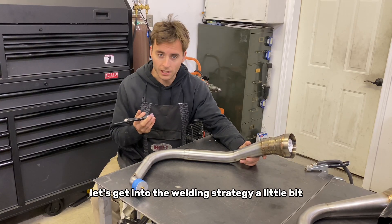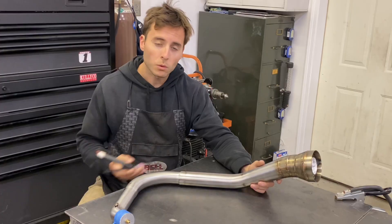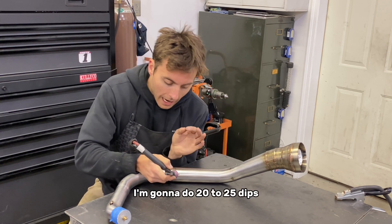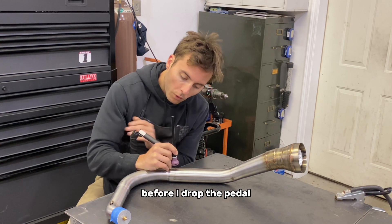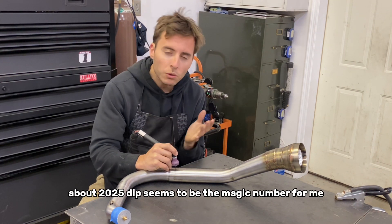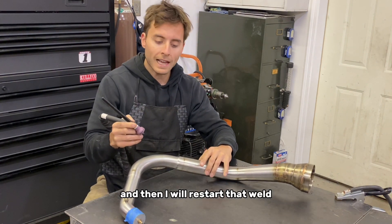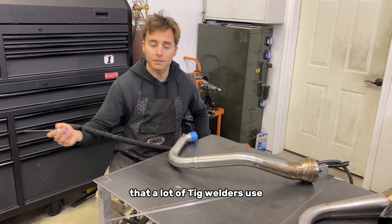Let's get into the welding strategy. Every welder is going to have a little different advice, but I've been doing this long enough where I've got a flow. When I'm welding my exhaust tubing, I try to do about 20 to 25 dips per start and stop. So when I go to light that electrode, I'm going to do 20 to 25 dips with my filler rod on this seam before I drop the pedal and stop that weld and let that post flow shield it out. About 20 to 25 dips seems to be the magic number for me. Then I'll rotate the pipe or get in a different position to where I've got my hands right again, and restart that weld for another 20 or 25 dips. I've always counted my dips as I'm welding — I think that's a really good strategy that a lot of TIG welders use.